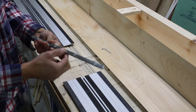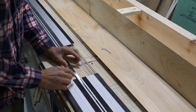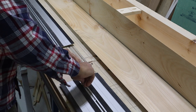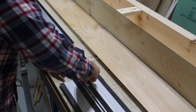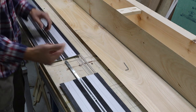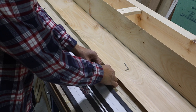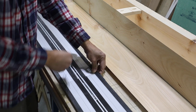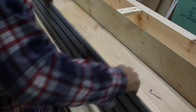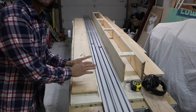To show you how this works, let me loosen the Allen keys and slide off the track connector. You can buy this from DeWalt, but I got mine from a company called Powertech — not sponsored — because it does the same thing as the DeWalt one at half the price. You slide the connector into the bottom of the track where the track clamps normally go, position it halfway, then snug up the bolts so it draws to the surface. Then slide the second track piece on, join them together, and you have a thirteen-and-a-half-foot straight edge.